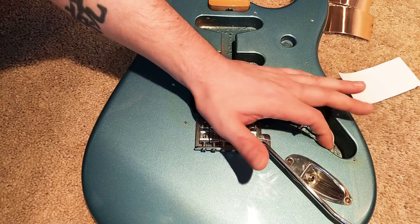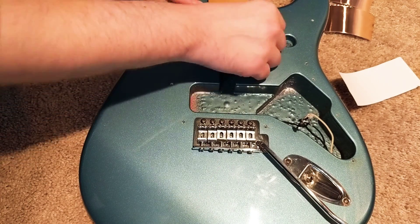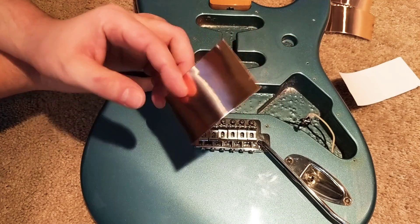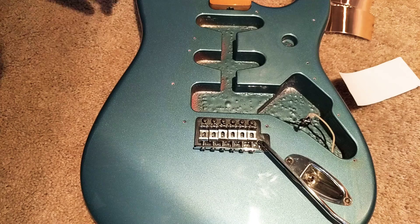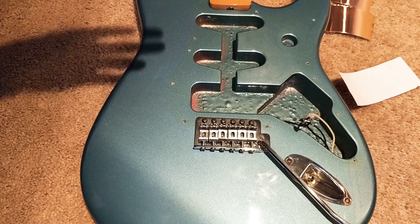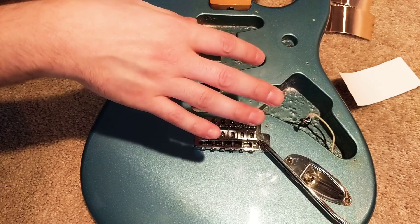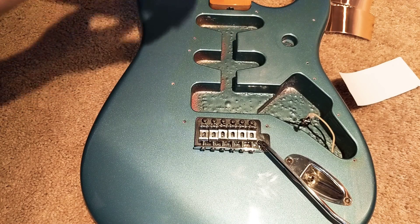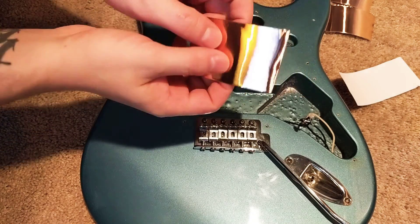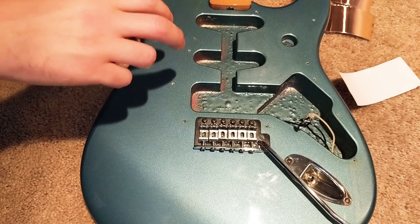If you're going to shield the inside of the input jack area too, I recommend you run a jumper cable and solder it together so you have continuity all around. If you don't have continuity when you're done, the job is useless — you just have a bunch of tape in there. I'm going to use this copper tape — it works great, I think it's by Tapes Master. I'll put a link in the description to everything I'm using, including a multimeter. You could use aluminum tape too, but you'll have to solder all the seams together — with copper tape you can just overlap it and not worry.